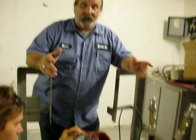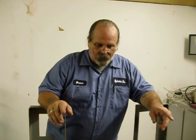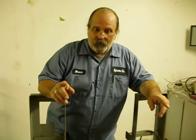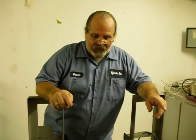This is voltage wiring for a WEG 9-lead motor. We're going to do 230 volt wiring first, then we'll do 460 volt wiring. Anytime you're changing wiring on a motor, always refer to the motor data tag that will have the wiring configuration on it. Don't second-guess it.